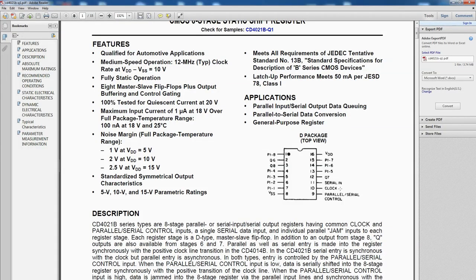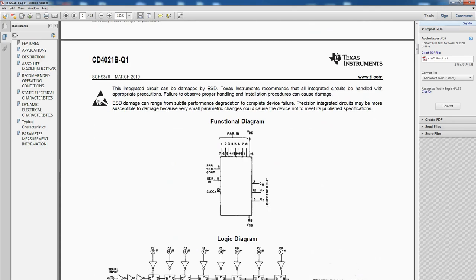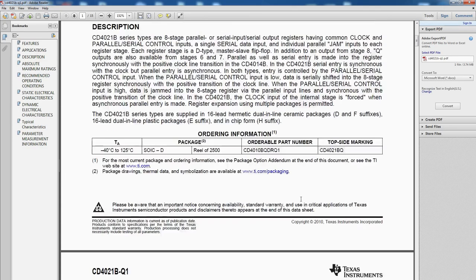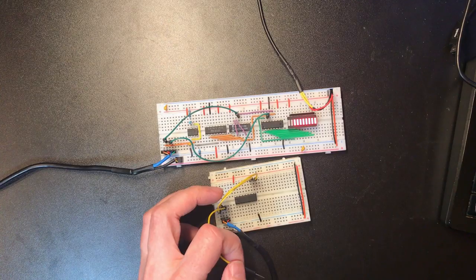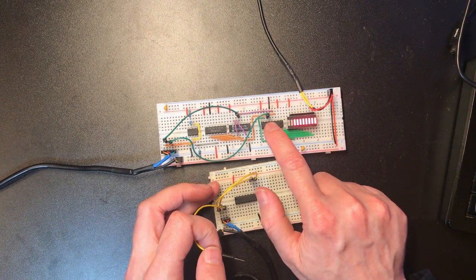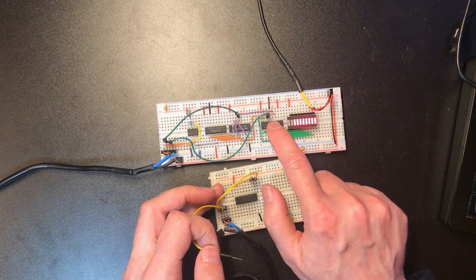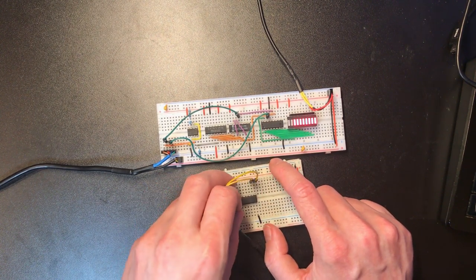Okay, so we've got Q6, Q7 and Q8. That sounds interesting actually. I'm guessing those are outputs. Okay, so yeah, buffered out. So I'm guessing that this is actually outputting the kind of top few bits of the shift chain. Okay, so when we do the latch output from here, we're immediately getting the first bit. So I'm guessing Q8 is what we want.